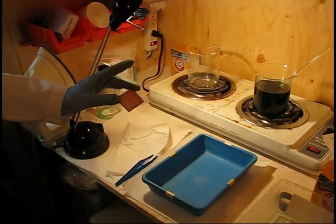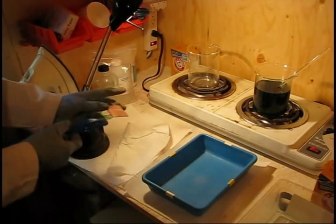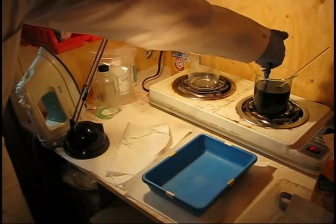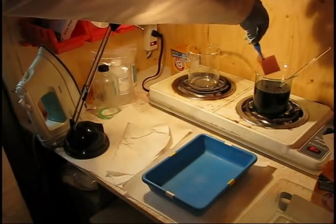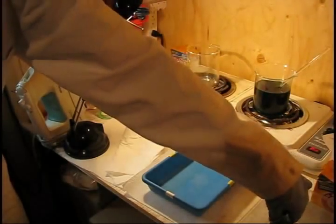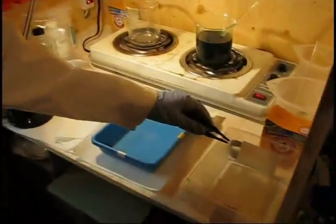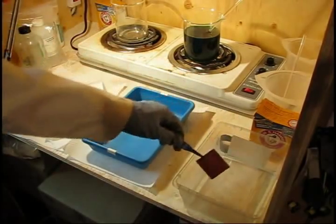What you want to do is take your copper clad, handling it by the edges with gloves this time, grip it using your plastic tweezers and just quickly dip your copper clad into your etch solution, which should still be a little warm, and then just place it in a small container of water. Once that's done, just pull it out and dry it off.